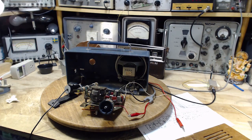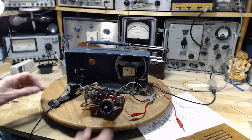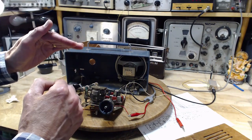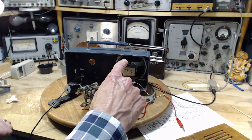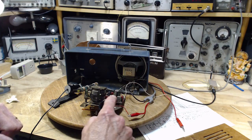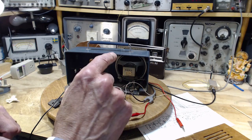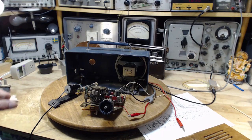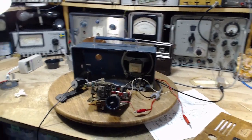That's supposed to be a 400 hertz tone. This is what 1,000 hertz would sound like. Clearly in my ears, that's a clipped signal. That's what that sounds like to me. So instead of being a nice smooth sine wave, the top or the bottom is chopped off. And when you get a sharp corner in a wave shape, you're getting lots of harmonics to generate that sharp corner, so to speak. It's not quite true, but that's good enough.